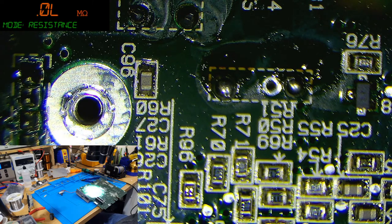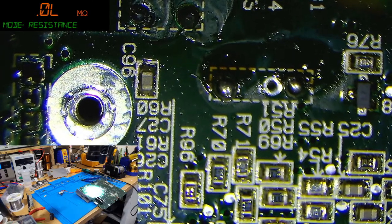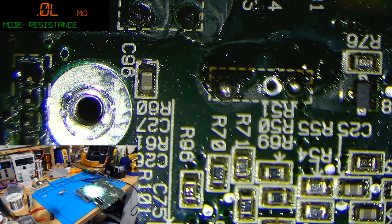Also, lower temp solder added to higher temp solder to make it flow. Yeah, that's true as well, Adam. But this board in particular already has leaded solder, so in this instance it doesn't make much difference. But you are quite right. If you're working on, for example, Xbox controllers or something like that, definitely mix in a bit of leaded, just a drop or two on each joint.